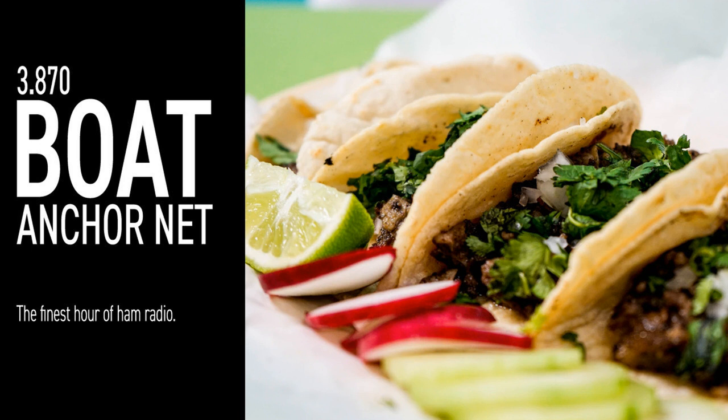I'm going to talk about this station real quick, then we'll pick up some check-ins and give it to Jay. I don't usually start the net with this rig because it's kind of a primitive deal. Collins built a VFO — actually a permeability-tuned oscillator — in 1948, called it the 310B, and used it with their big AM rigs. I'm using it as the VFO for Heathkit's first single sideband exciter, the SB10 Adapter, to adapt the Heathkit Novice rig, the DX60, to single sideband. That's putting out about 60 watts into the Collins 30L1, and I'm listening on Drake's first receiver, the 1A, from 1957.